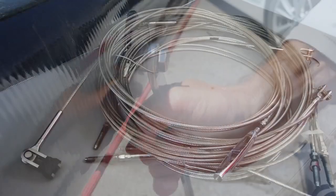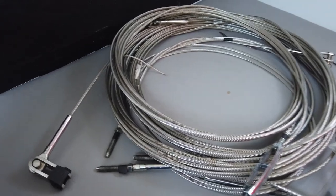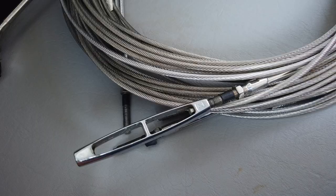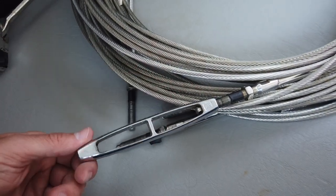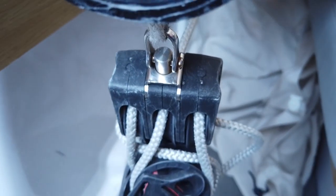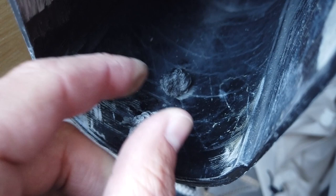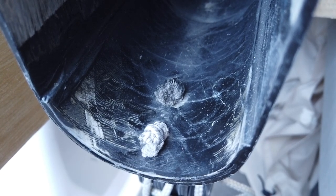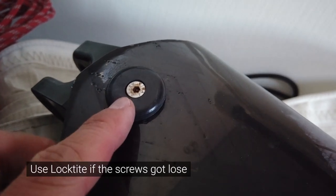Carefully check the shrouds. What you are looking for is permanent bends, damage, or deformation of the wire. Take special care at the ends of the wires where they are pressed into the terminals — that is usually the first place where damage happens. It is extremely important to lubricate the threads of the turnbuckles on both ends; only lubricated threads will enable you to reach the tension required for sailing the FIRST 27 in strong winds. At the end of the boom, the triple block of the mainsail sheet is fixed on a rope attachment point — check that the rope is not damaged or worn out, as you really don't want to lose the mainsail in strong winds. If you need to replace it, use a Dyneema core rope with as strong a cover as possible, no more than 6mm wide. On the other side of the boom at the gooseneck, check that the gooseneck axle is still secured with screws on both sides.